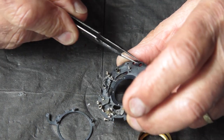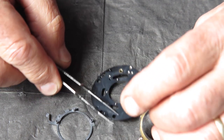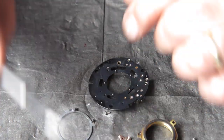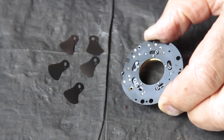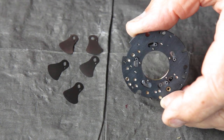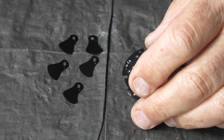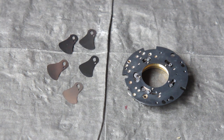There we can see this plate - the oil is really where it's been trapped underneath the retard gear train and delay action. A little bit on the other side of the plate, but otherwise that's not too bad. I'll clean that up, clean up the five shutter blades and then reassemble the shutter. I have the mechanism plate all clean now - none of that white powdery deposit is visible on that plate. It's all just nice and clean as it should be. The shutter blades are all nice and clean too.